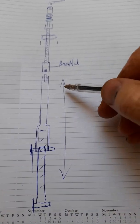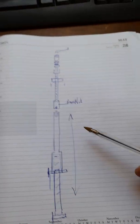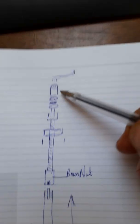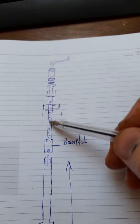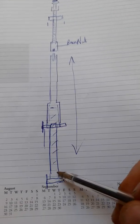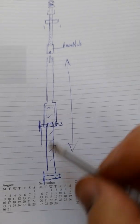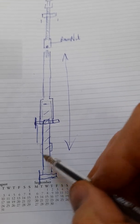This whole mechanism goes up and down with the hundred turns on the screw. It sounds complicated but it's really not — there are only a few moving parts to replace. Keep an eye on the bearings for wear, keep an eye on that thread, keep an eye on the brass nut, and then these straps. The straps have a sacrificial anode on one of them, but I think it should really come with two, so I'm going to put two on mine.